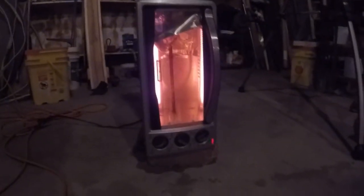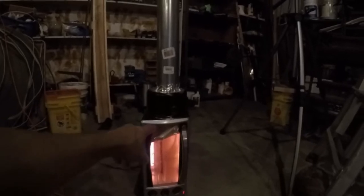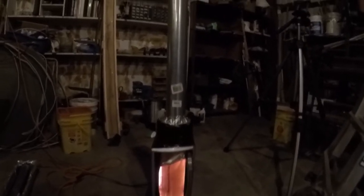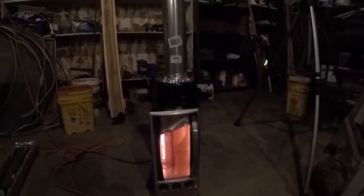So there it is in the tempering furnace. It's basically a toaster oven that I put a stack on, put a hole through the middle in this area so that I could do a full length sword. There we are. We're going to do three 30 minute tempers at 450 degrees.